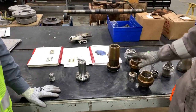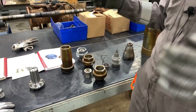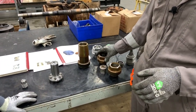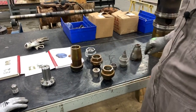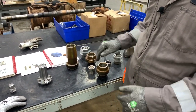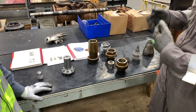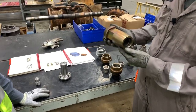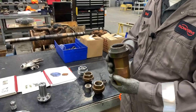The shorter slimline housings were used on the outside for the cutting and on the outward-facing nozzles of the boring. We did use these original short ones for the inward-facing ones, but we were finding trouble — it was impacting the performance of the nozzle cartridge. So we redesigned them to be a little bit longer to clear that area, so that when they did spray, you wouldn't be back-washing or washing away the cartridge itself. We introduced the long-nose slimline design, and these are only used in the inward-facing boring nozzle position.